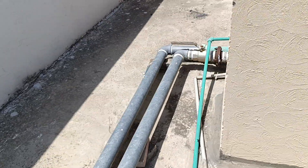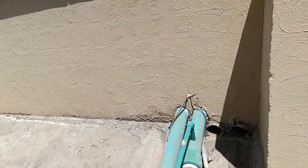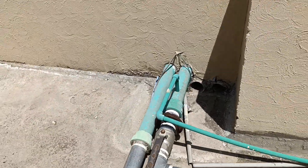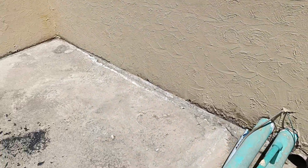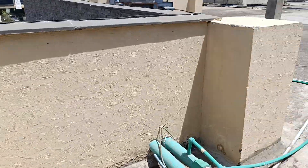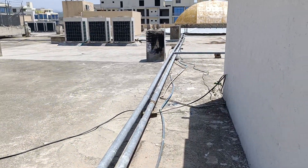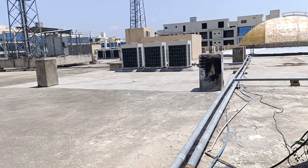This crack is not 100% treated. In this area you can see the cleaning of cracks — you cannot make them 100% dust free. We cleaned them about 24 hours ago and dust is already here again. We will remove this dust with water and wire brushes before treating it again.